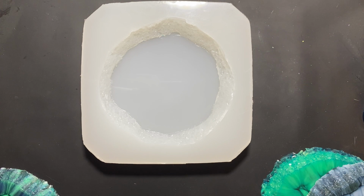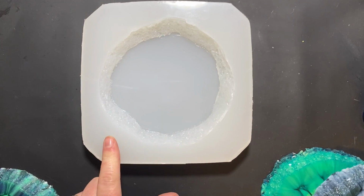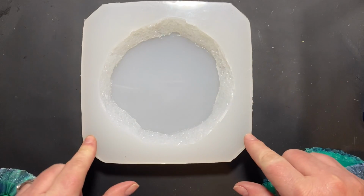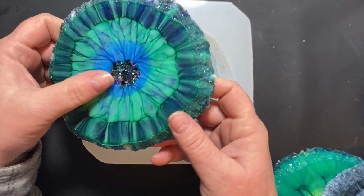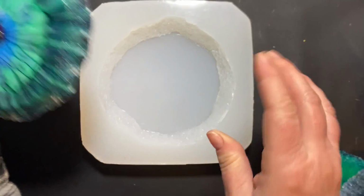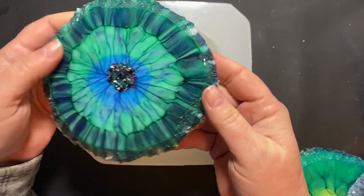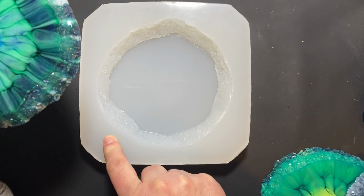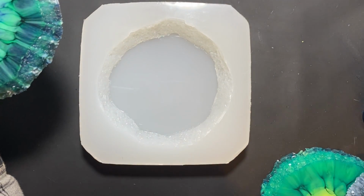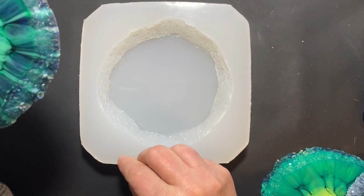Okay, so that's it for my mold making tutorial. As I said, it works a lot better, I think, if you do it in a flat, like with a housing around it, because it comes out level. So I did make this last night using this mold, and it actually came out level. I didn't have to prop any parts of it up, and it was filled exactly even all the way across. So I'm really, really excited. This is the first one I've made using my new mold. And this is using the Let's Resin silicone, and I will put links to it in the description.